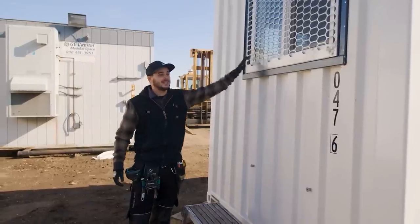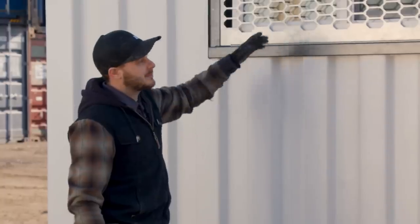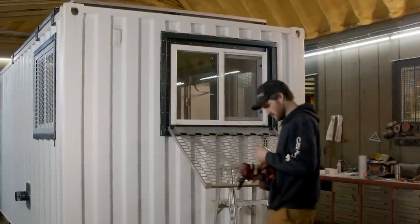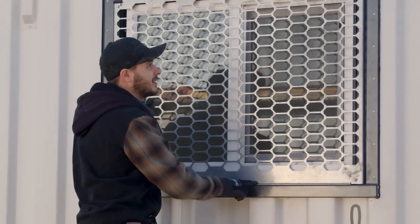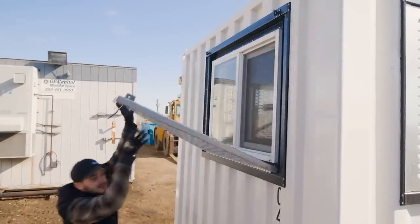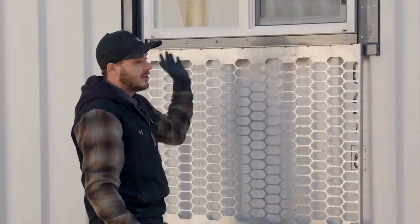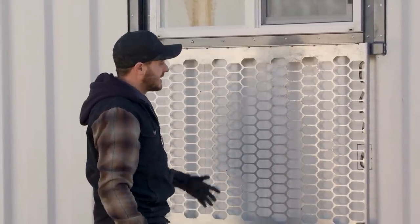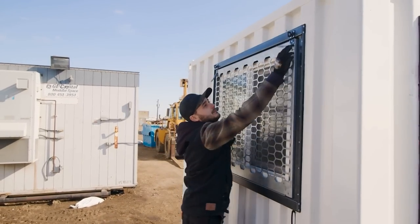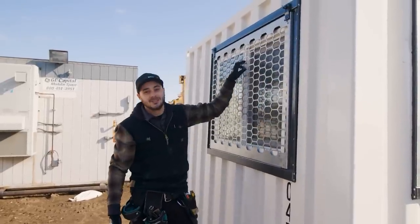Now we're going to give you a tour of the egress window. This isn't exactly an egress window because typically you'd open it from the inside, but in this instance they want to use padlocks, so we've tweaked our design a little bit. We've used a piano hinge along the bottom and gate-style latches up top — those just swing, and the user will be able to lower the window down and it rests on bumpers. Throughout the day as semis are driving by, the windows are open, and then at night when nobody's around the gravel pit, they'll be able to close it up. They just wanted to keep the honest people out, and that's what this will do.